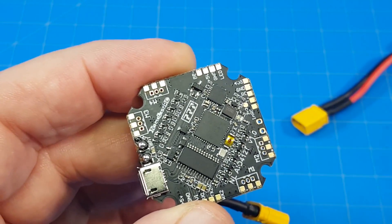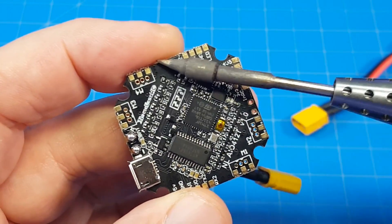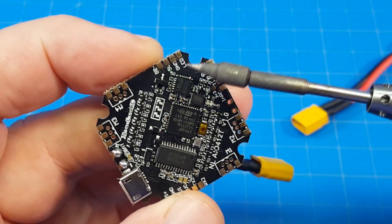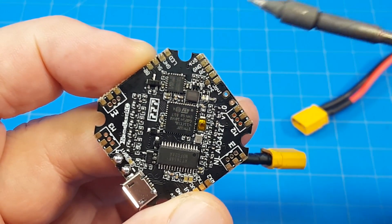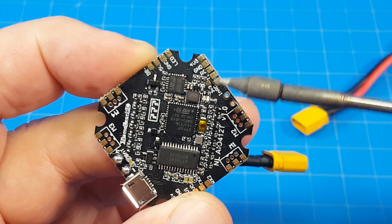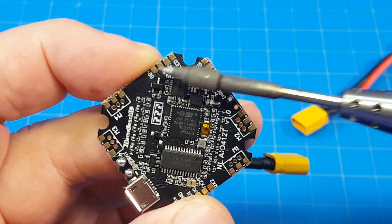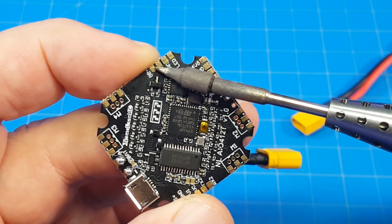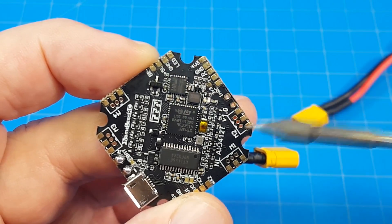Let's go around the horn. We've got our battery voltage plus and minus right here. This is for our motors, and the motors are cleanly labeled — M3, M4 — that corresponds to the motors on our ESCs. Over here we've got the LED, ground, 5 volt, and your buzzer. Your buzzer negative is on this pad where it's BB negative, and then to your 5 volt or your buzzer plus.